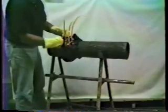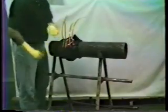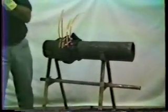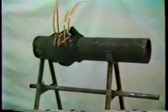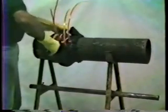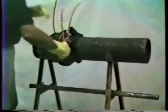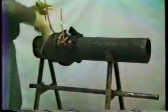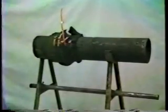Now hand-tighten the outer bell tie. Fit the tensioning tool over the inner hub tie, and with one hand squeeze until tight. Do not over-tighten. A separate trigger is used to cut the tie. Tighten the spigot outer tie, and then the outer hub tie. Pull the inner spigot tie hand-tight only. Do not use the tool.